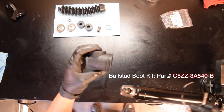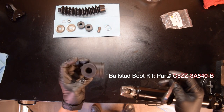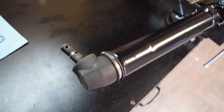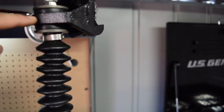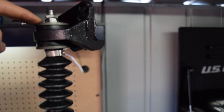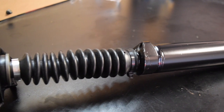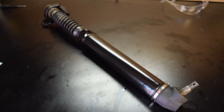One thing I forgot to mention — you will need another boot. It comes in another kit, none of the previous kits include it. It's just the ball stud boot, which comes with the boot and the zip tie. So the boot is now on — it just slips right on. This is now complete. If you're doing this, you want to put it in this order: the tie, the washer, bushing, the bracket, and then backwards — bushing, washer, your nut, and then your locking nut on top. So that's it — if you have any questions, comment them and I'll try my best to answer them. Thank you for watching.